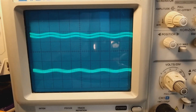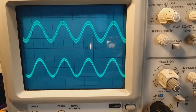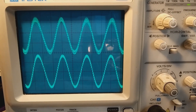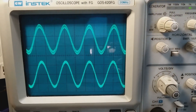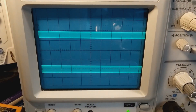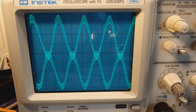This is the output of the preamp — and this is where it gets interesting. It's now connected into the Class D amplifier and you can see there's a hell of a lot of noise on it, which is about 270 kilohertz. You won't hear it because it's too high a frequency, but that's one issue. The signals are in phase here, which is fine. However, looking at the actual amplifier output, we still have this massive amount of noise — mostly because it's a cheap board with no filtering. But the bigger issue is that the signals are actually out of phase.